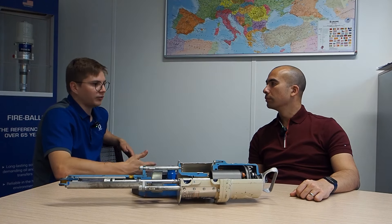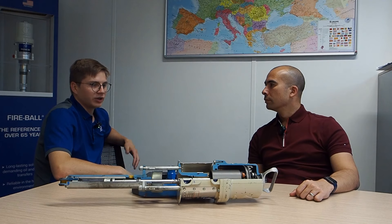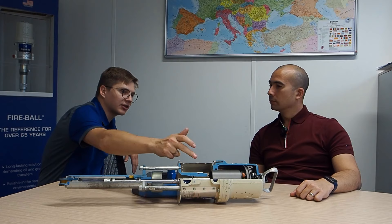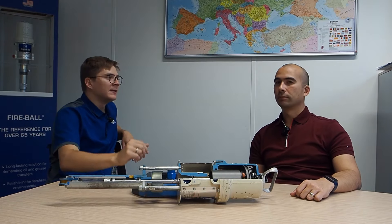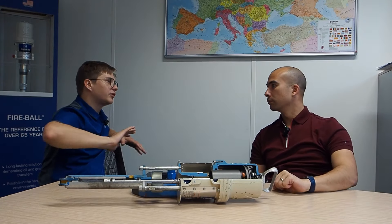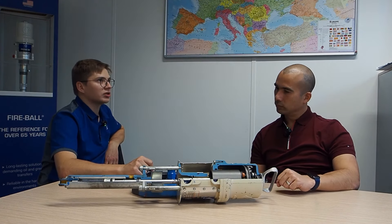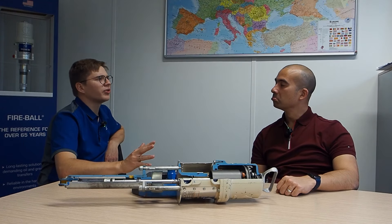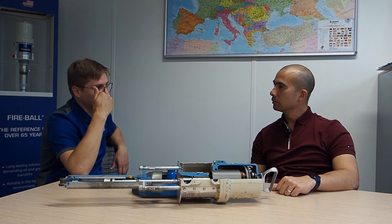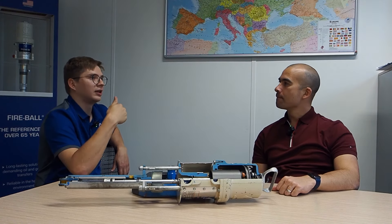Graco does a lot of stuff moving different kinds of fluids, sharing air motors between divisions. We have a really nice pump with a 36-to-1 pump pressure. We took a 7.5 cubic inch air motor, put a big lower part on it, and created a 36-to-1 pump which can give pressure of 3,600 PSI - around 250 bars - which is pretty decent pressure when you just need to move. It also gives a flow of 14.5 kilos per minute, which is insanely higher - like seven times higher. It can easily transfer a drum of NLGI 2 grease within 15 minutes.